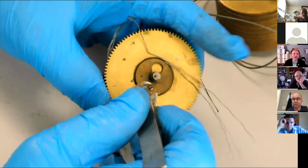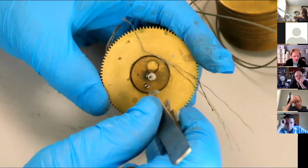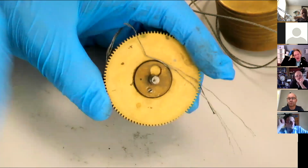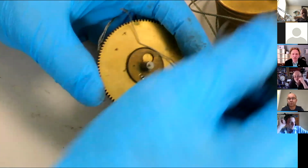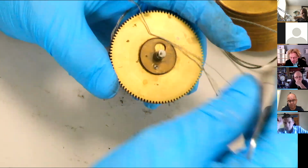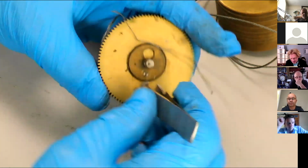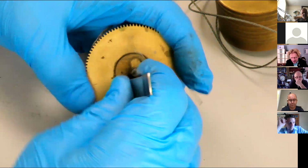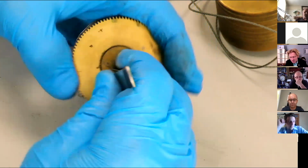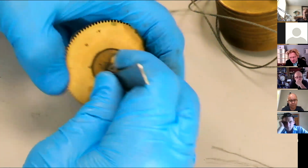Annealing it first. When Derek says anneal it first, you mean the brass, Derek? Or the screw? Yes, the brass. Yeah, I mean, you could certainly normalize it. With brasses, you can relieve stress, of course, we don't want to anneal it fully because it won't do its job. It might be too soft. Although saying that, good point, Reed and Derek. Of course, the thing is soft in the first place because it's a casting. So yeah, you could anneal it. There's a temperature, if you've got a kiln, called the normalizing temperature, which reduces stress within the material.